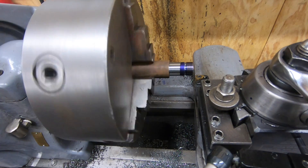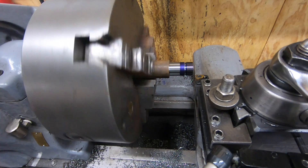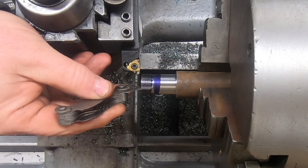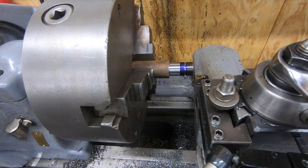Not only does that look better, it is better - we are now set up for 24 TPI. I chose that thread pitch for no particular reason, I just wanted to cut it at 24 TPI. But I learned from other hobby machinists on YouTube to always cut scratch passes, and this is a prime example of why that's always a good idea.